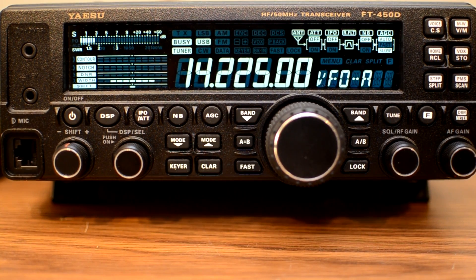Hey, Tony, KD8RTT. I'm going to do a video showing off the DSP features of the Yaesu FT450D. It's got some really cool things that can make picking out a signal much easier. I'm just going to go through what the features do and kind of how to apply them. I'm going to move through the bands to find signals to test against. There's the contour, notch, DNR, width, and shift — they're all really ways to reject interference and they make things a whole lot easier.